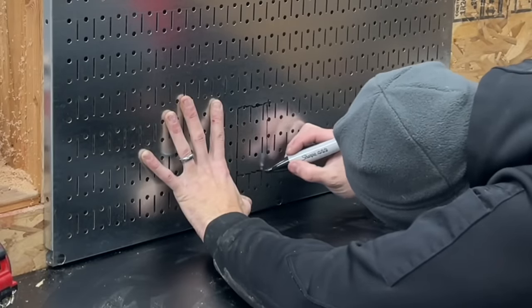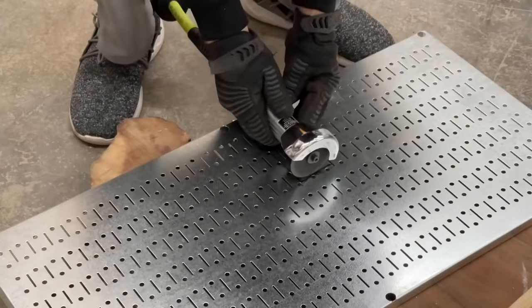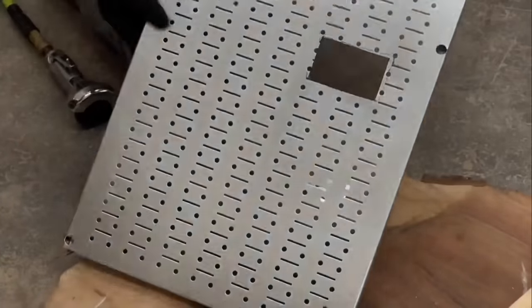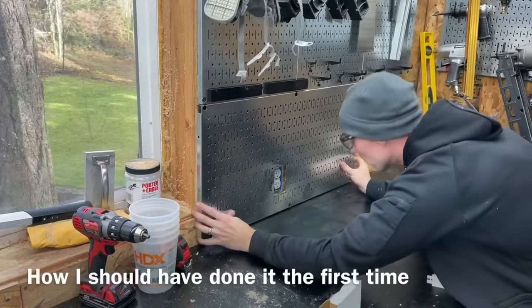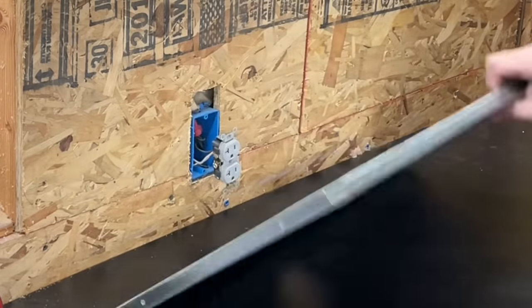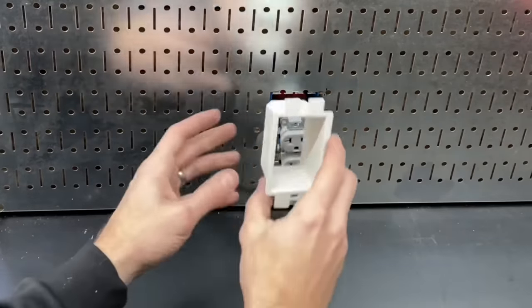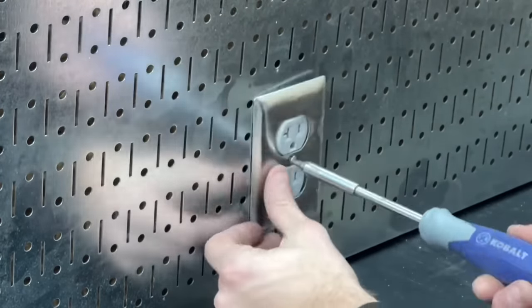I finally got replacement wall control panels properly oriented for horizontal mounting and cut the holes with my cutoff wheel for the outlets. Cutting the galvanized steel might not be the best idea if you live on the coast due to rust concerns, but I'm not too worried here. I found these really cool outlet extenders — little plastic inserts you slide over — that bring the box out for a nice clean flush mount look. Make sure to turn your power off especially around galvanized steel.